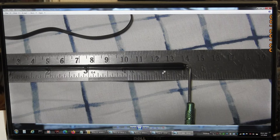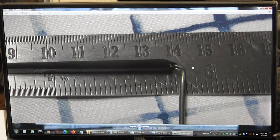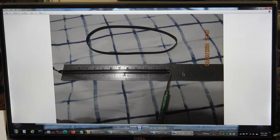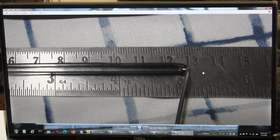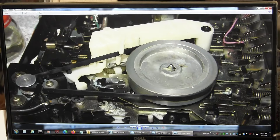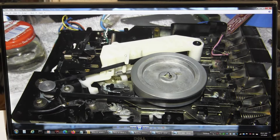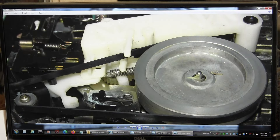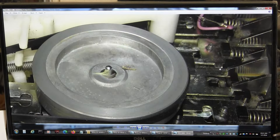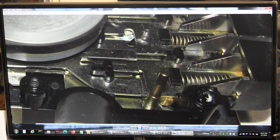Here is the old driving belt from the capstan motor to the flywheel — it's nearly 14 centimeters. Here is the new belt I put in — it's nearly 13 centimeters. That's the capstan-to-flywheel belt. Here is the new capstan belt installed. All the flat pieces have been restored, and everything — all the springs — are back in place. All the springs have been restored; they're all straight in, not flopping out.